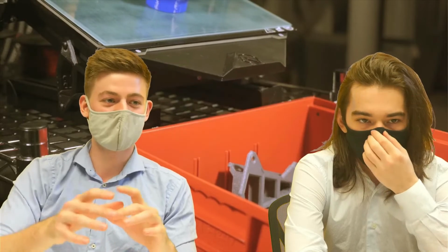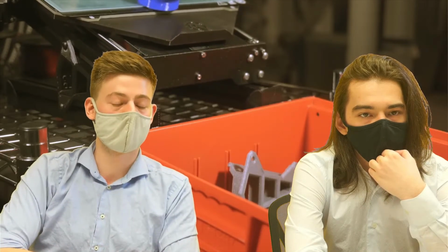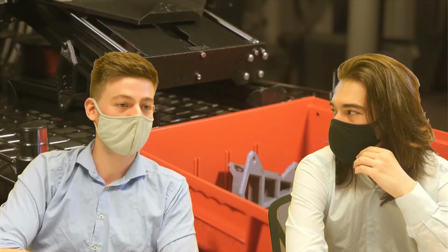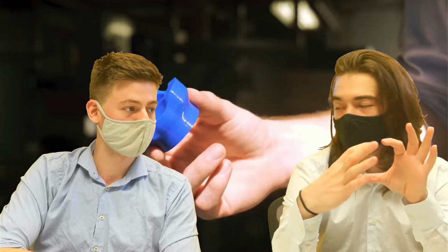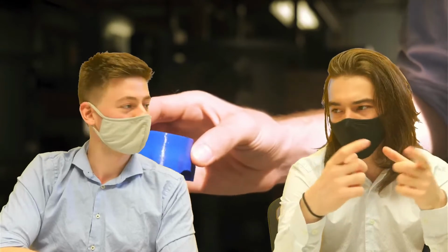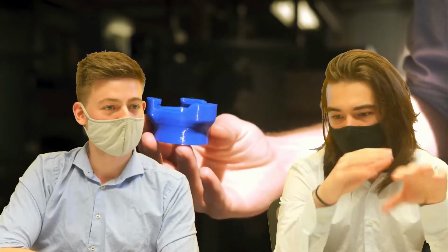Yeah. If the parts don't cover a huge build surface on the plate, it's probably fine. I printed ABS with relatively small build footprints, unenclosed, and I've done bigger parts and it was fine. I haven't pushed it really. I was printing Pi enclosures in ABS and they were fine. And I think they're a really warpy shape, thin walls and a huge base.